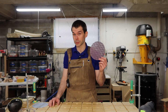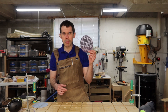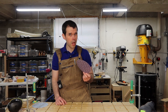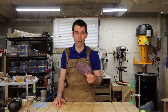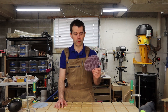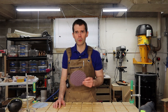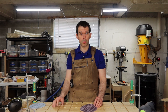Here's what I discovered: the removal claims made for these sanding discs are no joke. They plowed through my workpieces, making short work of the sanding process. The other thing I discovered is that it's virtually impossible to leave swirl marks with these discs. I even tried to do things that commonly led to swirl marks with Festool sandpaper and got nothing. On softer wood like cherry, it was impossible to pick out any blemish, and on harder denser wood like sugar maple, any marks at lower grits were quickly removed at higher grits.